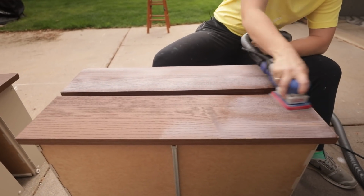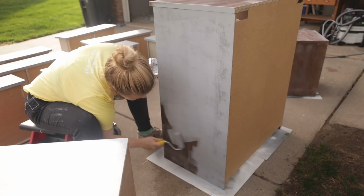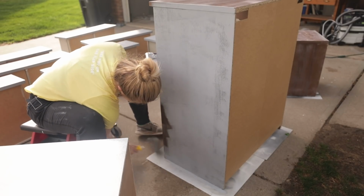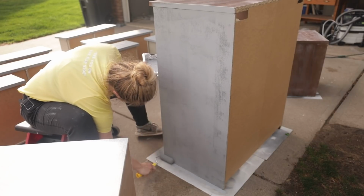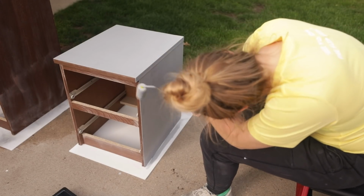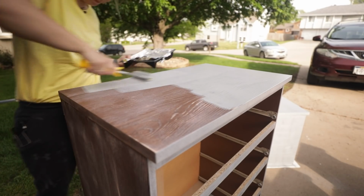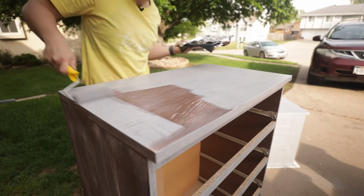After cleaning, I did a quick scuff sand with my Surf Prep sander just to smooth out those scratches and roughen up the surface so that the primer could grab onto that better. I used a gray Bin shellac-based primer that I had them tint at the hardware store because red shows up way better on the gray than it does with the white.